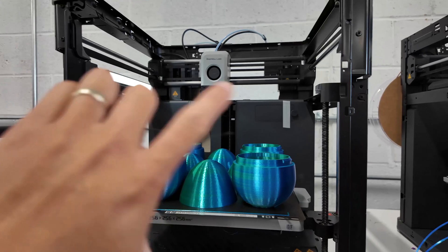With my previous Prusa MK3S printers, common issues included the bed thermistor wearing out — both the heat bed and hotend thermistors would go after about six months of printing. But from my experience with the Bambu Lab printers, some of which I've had over a year and others for eight months, the majority still work perfectly fine without any regular maintenance. Regular maintenance for us is just cleaning the Z rods and dusting the fan cover.